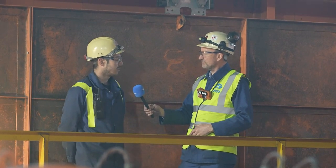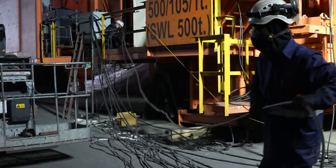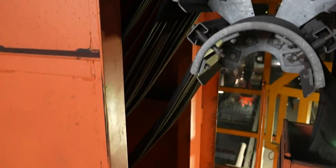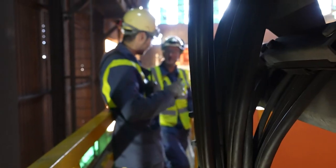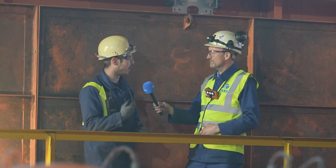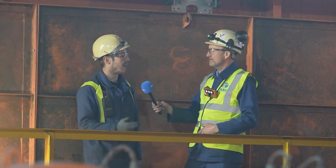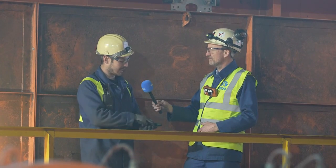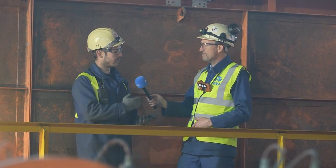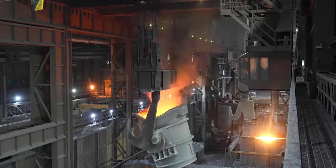Pretty complex. Once the main parts are cabled up on the floor as part of our pre-assembly process, when we lifted up onto the gantry and bolted all the pieces together, we then run hundreds of cables from boom to boom and from boom to trolley. That transmits the power around the crane and also the networks for the control systems — there's a complex system of networks around the crane including our main control system and our safety control system.